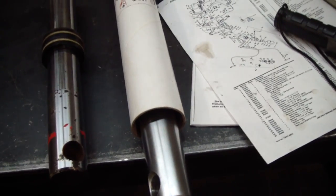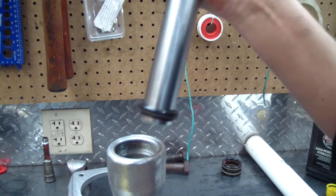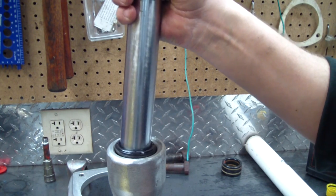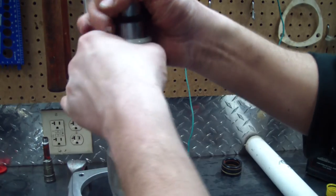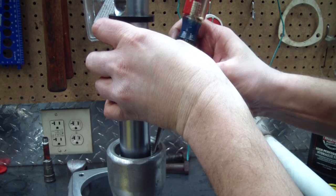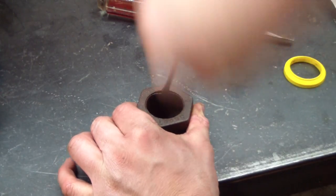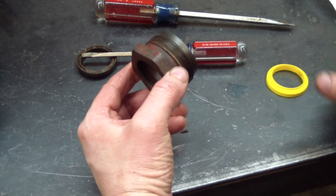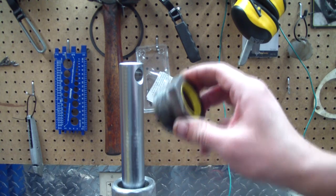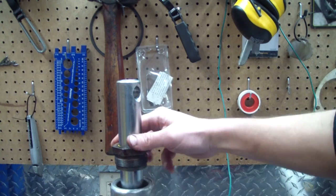There are a couple of nicks in the ram so I got a new ram for the head and I'm getting ready to install the packing set — I'm pretty much going to do it just like the old one. Those packings sit on the top side of this tube. I've lubricated all the packings with the hydraulic oil that I'm going to be using, and I'm going to try to work these packings in one at a time past these threads using a blunt screwdriver to work them down. Here's my nut and the wiper seal — the kit came with a new one. I'll wire wheel this down and put a little grease on these threads, with some hydraulic fluid on the wiper seal.